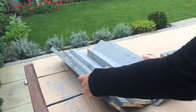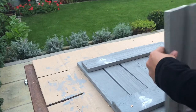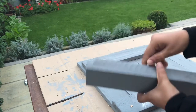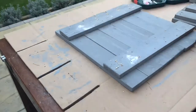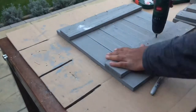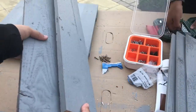I'm using these four pieces of wood from the palette again for the sides or the supports of the roof of this table — these are about 10 inches long. I'm just trying to demonstrate how these pieces of wood will go on the upper side of the table. My husband is here helping me with the actual building, so he will be doing everything involving the power tools. He first drilled pilot holes on both the vertical pieces of wood and then screwed them from the top piece of wood to the bottom piece of wood so it's all secure, with four screws per piece, which made the table really sturdy.